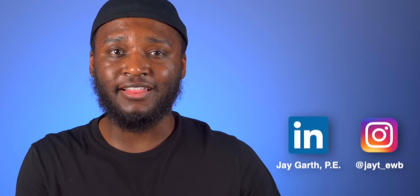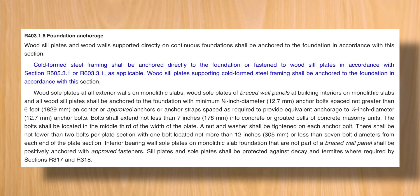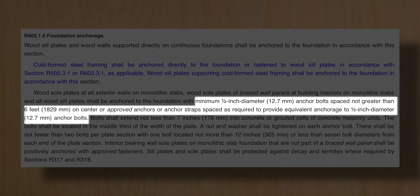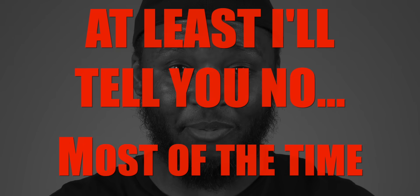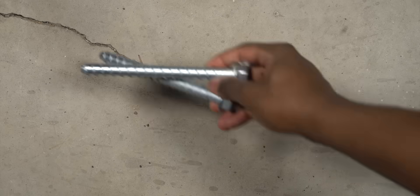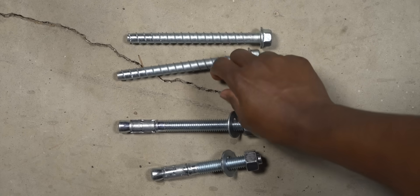I'm mentioning this recognizing the fact that the International Residential Code allows L and J bolts as a foundation anchor. So depending on the codes where you live, they may be perfectly fine. However, if you ask an engineer about using L or J bolts, they're most likely going to tell you no. For individuals who don't have a lot of experience doing building construction, there are so many options that provide the same capacity as an L or J bolt without all of the skill necessary to install J bolts correctly.